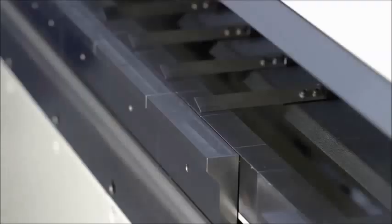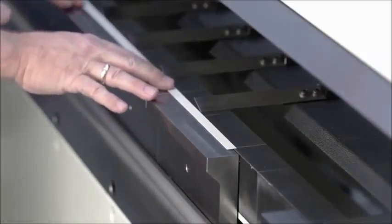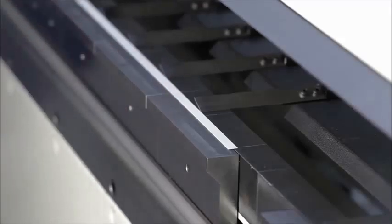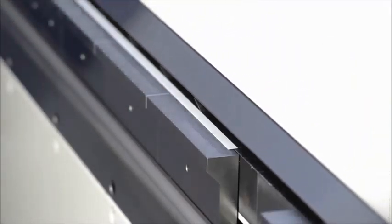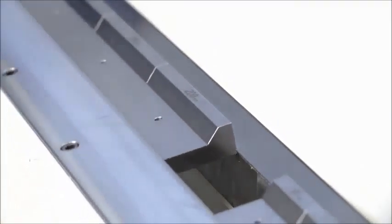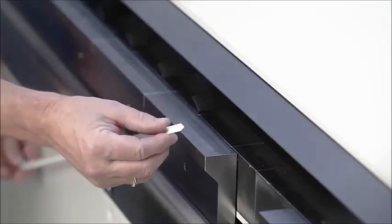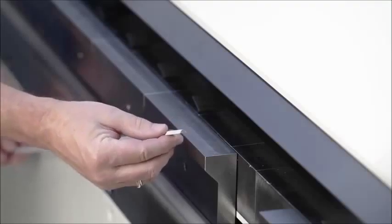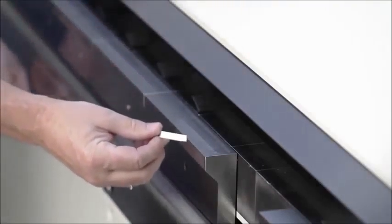The front fingers have spring steel plates that allows you to make bends starting from only 2 millimeters. Here you see the first line of fingers in the front position between the tooling. During the bending process, these fingers will remain between the tooling. Here you see the operator bending a small flange of only 4 millimeters in 1 millimeter sheet thickness. This solution has another important advantage, because the lower tooling doesn't need to have grooves for the back gauge fingers, as these grooves create marks in the sheet being formed.